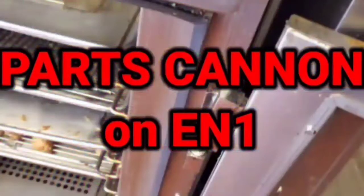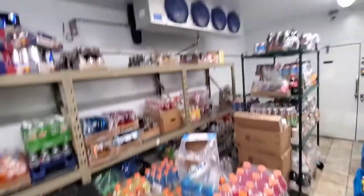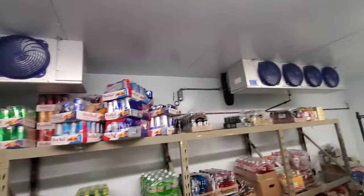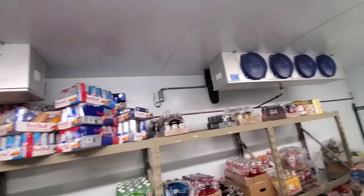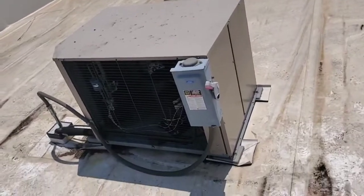What's it do? It's symbolic — Molotov. What do you call this kind of box? Is it just a drinks walk-in? A walk-in is like the suffix — whatever's in it comes before. So this is the energy drinks and soda walk-in right here. And it's not doing anything. It's not cool and the fans are rolling. That's all we got. Condensing unit's not doing anything.